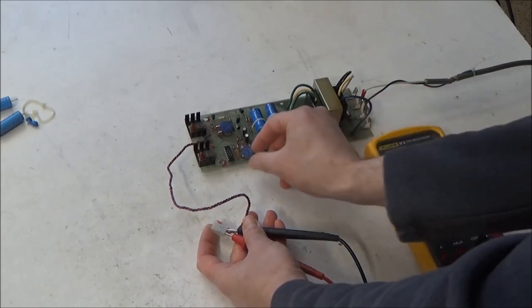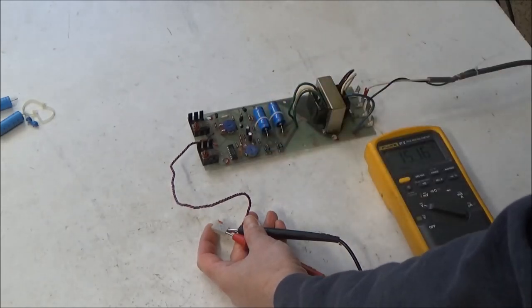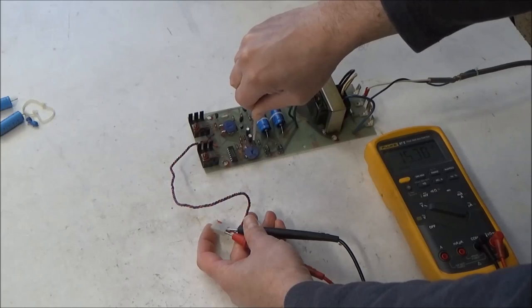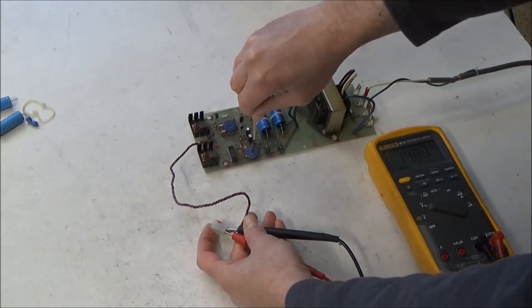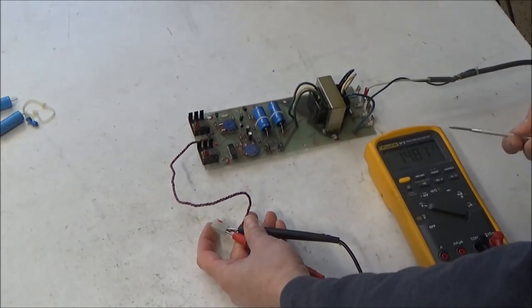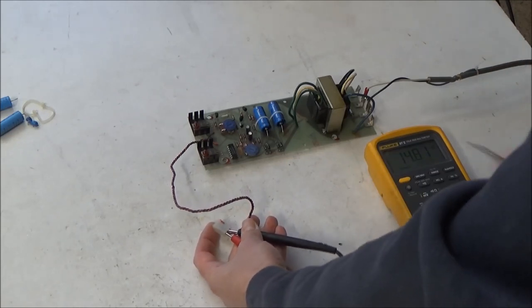So what I'm going to do is back it off now. I'm going to back it off down to 15 volts or a little under 15 volts. Again, we'll calibrate it once it's installed in the synthesizer and connected to a load. Calibrating it now does no good. You just want to, again, prevent yourself from exposing stuff to overvoltage when you plug it back in.